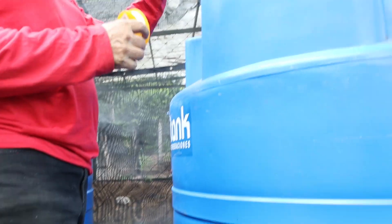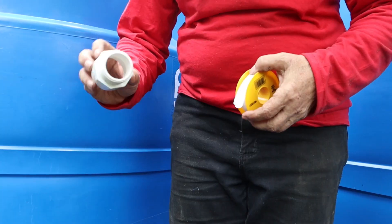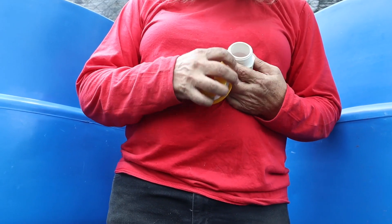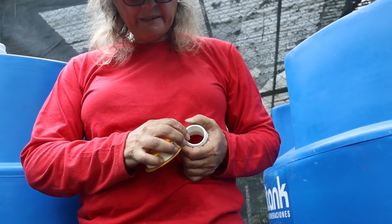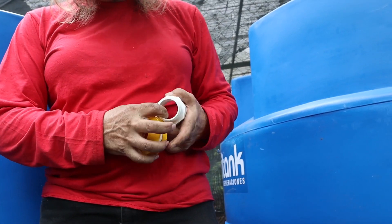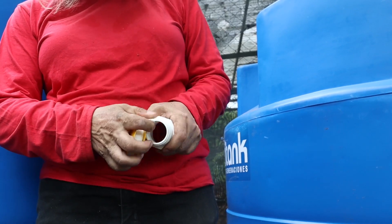The last thing we have to do is put some Teflon tape on here. This is not easy because the twist goes in one direction, so you want the Teflon tape to go in the opposite direction. If you don't put Teflon tape on, you wind up with leakage. It has to be put in the opposite direction that you're turning. You just stretch it out around there — you're not trying to go crazy with it, just enough to fill in the threads so that water cannot escape.